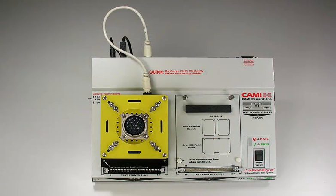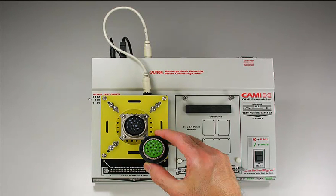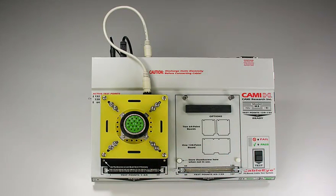To begin, attach the connector you wish to assemble. With the workpiece attached, you're ready to begin. If this workpiece represents the first connector in your cable or harness, you'll be attaching wires not connected to anything else. As a result, we must rely on a color code or a numeric code printed on the insulation to identify the wire.